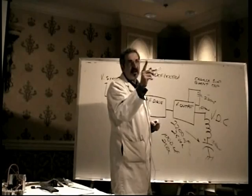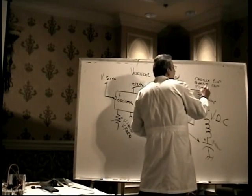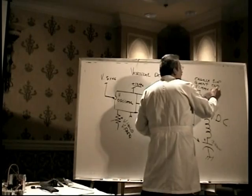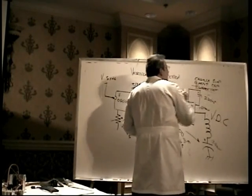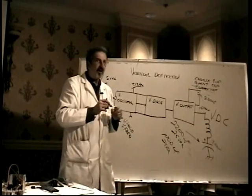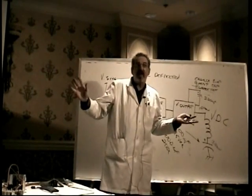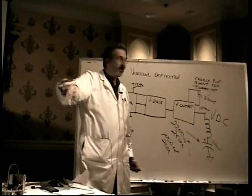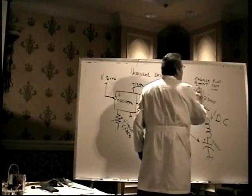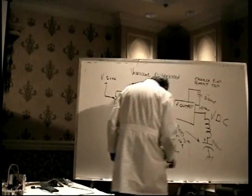I disagree with this. Ray, I'm going to run this by you. I disagree with this term, but I've seen it labeled flyback cap. Have you seen that, Ray? Never seen that labeled flyback cap? I understand why they might have called it that. I disagree with calling it that because typically in a monitor, when we talk about flyback, we're talking about the horizontal flyback transformer, the high voltage transformer. So it's called the charge pump or the boost cap or the pump up capacitor or whatever.